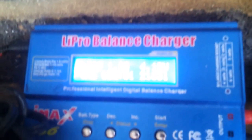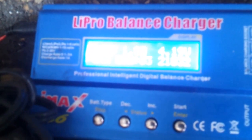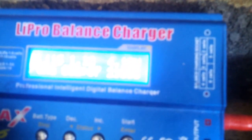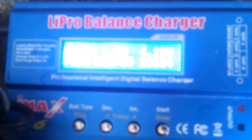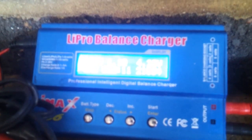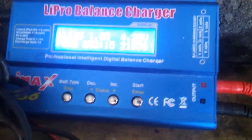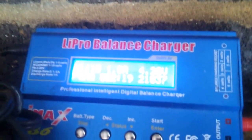The good thing about having a dumb charger is that the smart charger doesn't like it. If you plugged in a 1S pack and it was averaged out at 2.1 volts or something, that won't charge it — it'll just report a low voltage error. If there's any way around that, let me know. But that's where these things come in handy, because they'll just constantly put the 4.2 volts in.